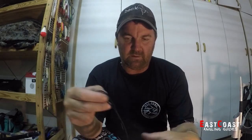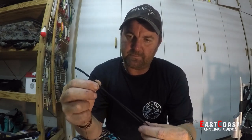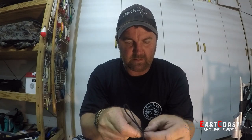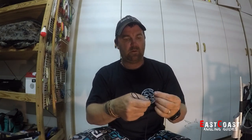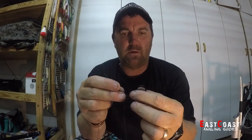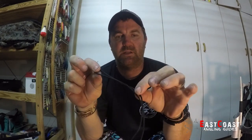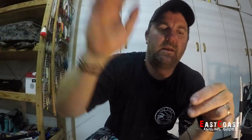And even that would probably be enough. Let's just check here. I'm going to go through one more time here. All nice and flat. Okay, so at this point, your splice is essentially done. Now, this is where other guys get all technical with double splices and this one slides. I'll show you the way I do it on this heavy stuff, and it does not let you down.